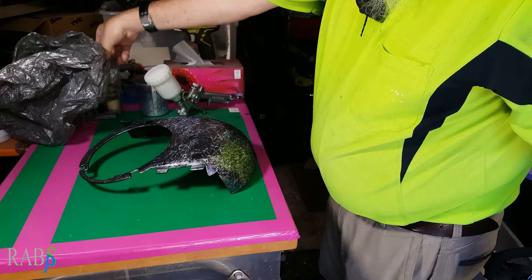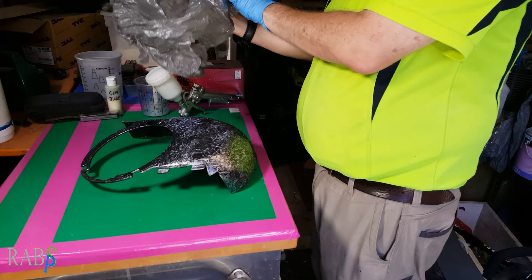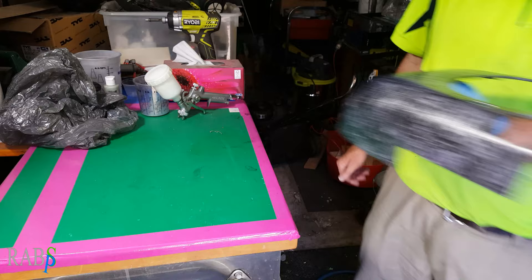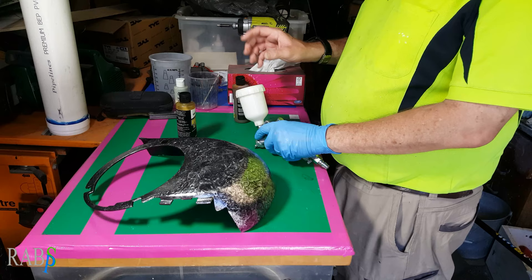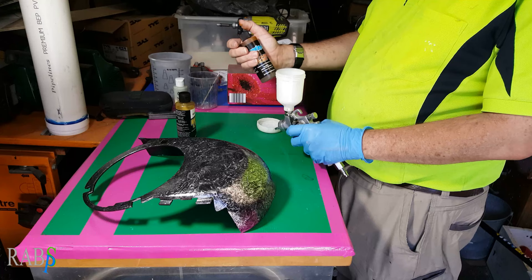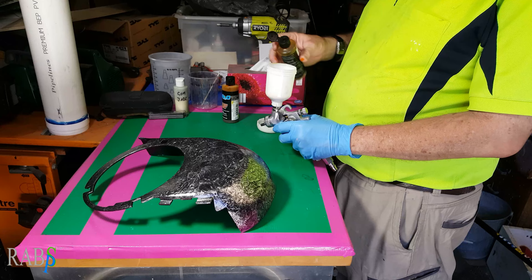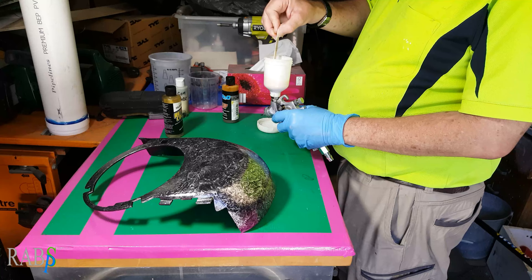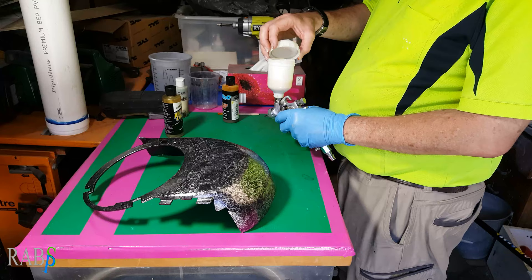So that finish is pretty simple — it's all done. Now we just need to wait for it to dry. I'm going to put that outside to dry and when it's done we're up to the candy stage. Now it's time to mix up the Tequila Yellow Sunrise candy paint. This is an O2 candy, so it's a pure dye. Rather than mix it up and get it everywhere, I'm mixing up directly in the cup, just adding a bit of reducer. I'll mix it up and then leave the gun with the paint in it for 15 minutes, then get on with the candy application.